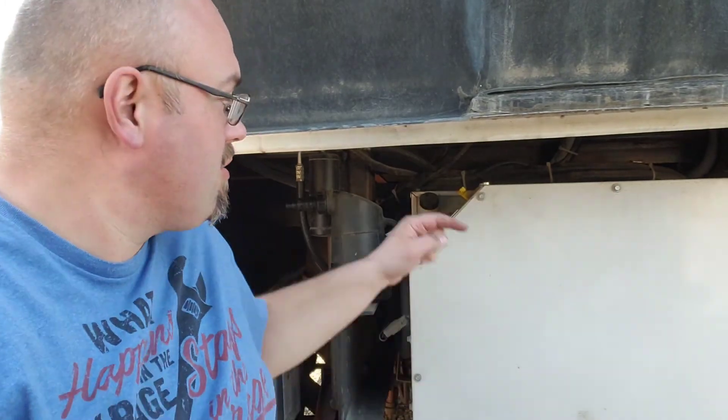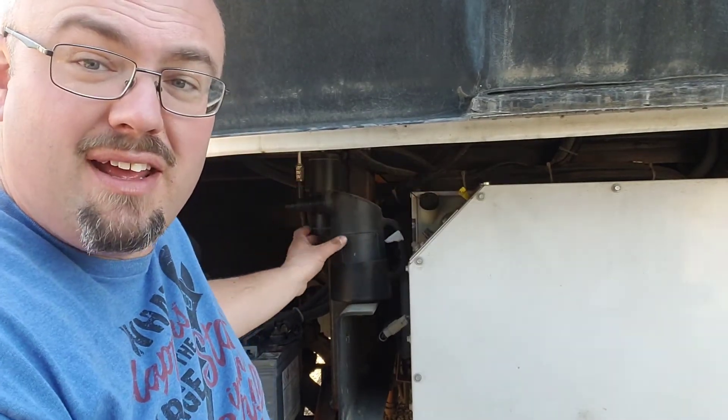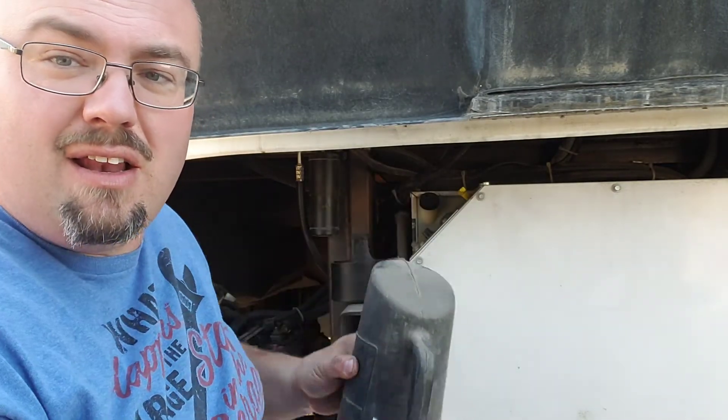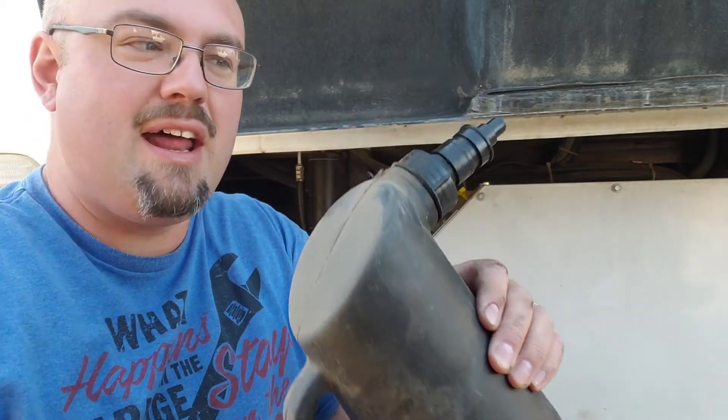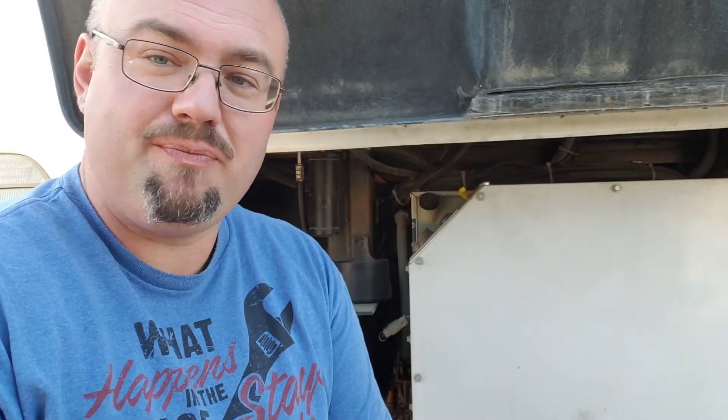The oil is drained — that's the easy part on this. Now they put that impossible drain fill location right there on top of the generator. It's a difficult challenge. But they give you this nice handy dandy little oil filler doodad, spring-loaded tip and all. The only problem with this is it's impossibly slow. I'm going to fill this guy up, stuff it in that little hole, and just fill till it's filled. I believe this takes about three quarts — I'll confirm when I'm done, but three or four quarts is the answer.